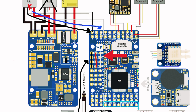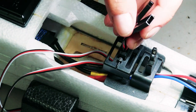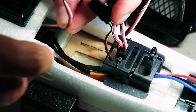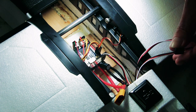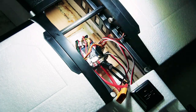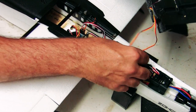S5 and S6 will be for the V-tail. The V-tail wires here are going to plug directly into the servos. I'm not sure which is which so this is trial and error — we may have to swap them over. I'll feed these through underneath the GPS and towards the flight controller. I want to set it up and make sure I've got the right wires in the right pins, so we'll connect as is. There are our four servos connected. I won't cut these wires any shorter — it's handy to have that bit of play.